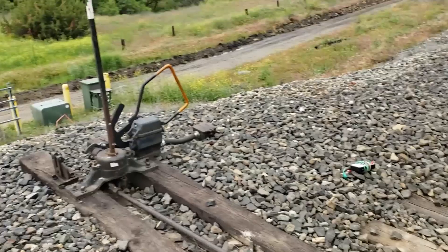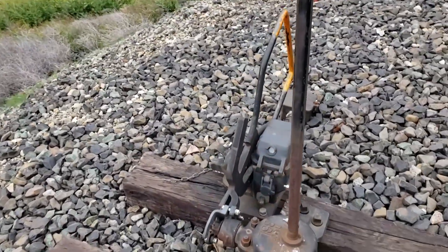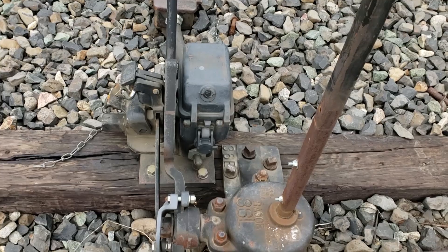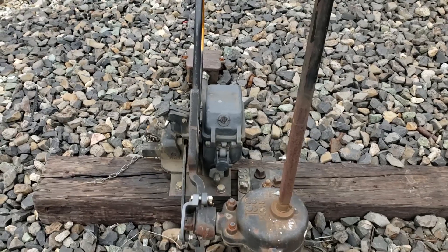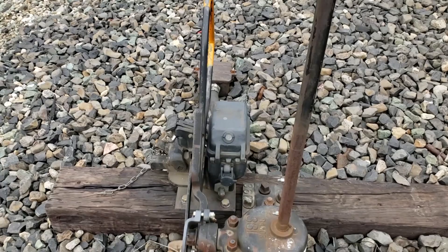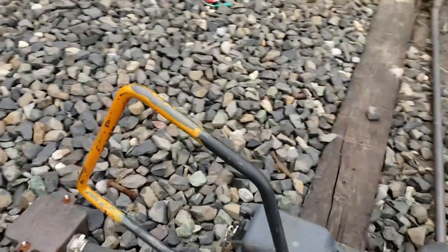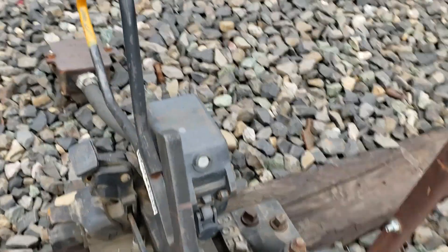What we have here is a hand throw switch — this switch has to be thrown by hand, and it is an electrically locked switch. That right there is the Model 10 electric lock. These are the ones we have gone to over the last 10 years or so. They still use them in some other parts of my territory; I have the SL6 high locks and we'll see those next. The way an electric lock works is if there are no trains on the approach in either direction to this signal block where this switch is, or if there are no signals cleared, you can just walk up here, unlock this lock, take it out. You can see that little green light in there — it tells you that the switch is ready to unlock. Step on that piece, unlock it, and throw the switch.